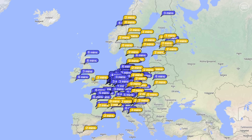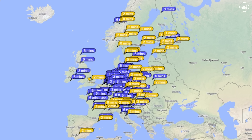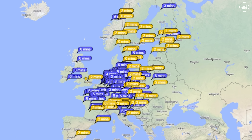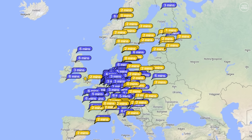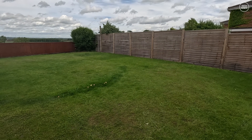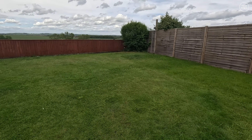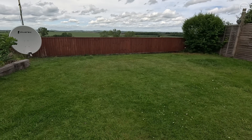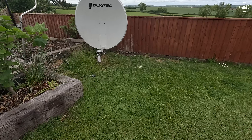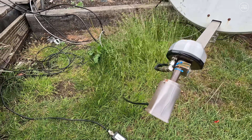Raising it off the ground appears to work better at least for transmit, but the noise floor does rise. I'm wondering if putting the loop up at around 10 meters off the ground would result in stronger received signals and a better signal-to-noise ratio compared to when it was lower. Just remember this experiment was just for fun, and if you try this at home you'll most likely get different results. One thing for sure: with a loop on the ground your noise level should be lower, but then again so will the received signals.